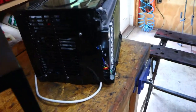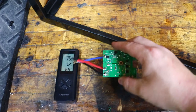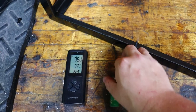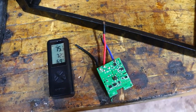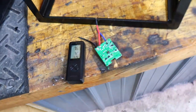The problem was I didn't have a thermostat and didn't want to run extra wires, so I got an outlet thermostat. I took it apart — it has a neutral, ground, and live wire, plus a switched live. Your neutrals are shared; the incoming power feeds the thermostat module and then goes to the air conditioner. On cool mode it turns the outlet on when it's too hot and off when it's too cold. It also has a built-in three-minute compressor delay to prevent short cycling, which also reduces the high startup power draw.